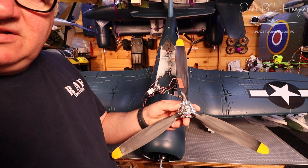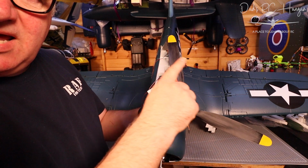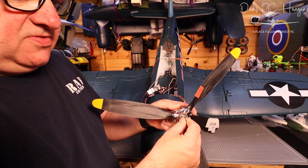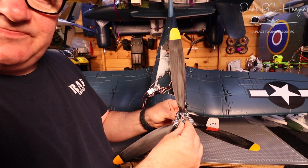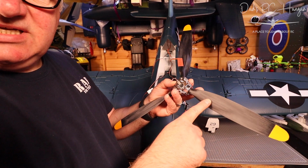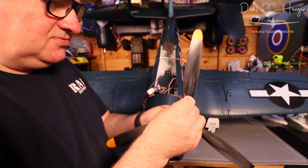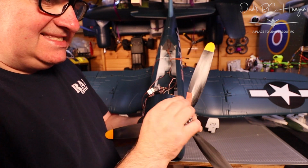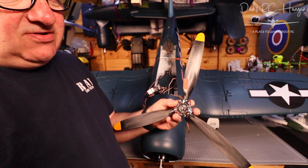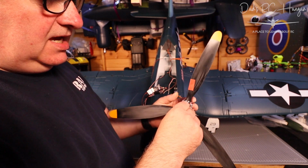So I'm just having a look here because then I can see it on here. By putting that there, the blades were totally balanced. Any which way on the balancing wheel, it was balanced. So that means that then I've got to take more, like this amount. I need to weigh it on some super scales to let me know, because that weighs nothing. But that nothingness, when that's going around at the RPM this does, will add big vibration.